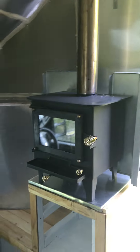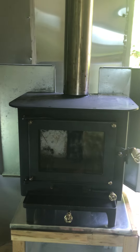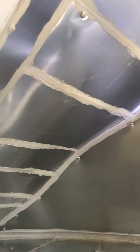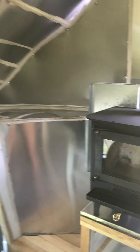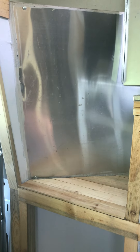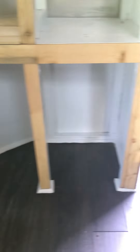Spinning around to the fire nook — this is the Cubic Mini Grizzly Cub wood stove, with custom piping and an H-pipe. The wood pieces are about three to four inches long. We put metal flashing along the back and sealed it with heat resistant caulking. We installed a hot plate station right there on the side so you can transfer from the wood stove to the holding plate with ease. The silver flashing continues down so you can utilize the space to dry wood. We had a rack system to dry mitts and whatnot during the winter, put our wood to season in this nook, and had a wood bin down there — a nice staging system we really enjoyed.